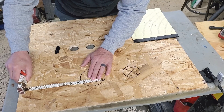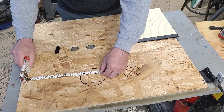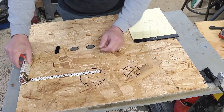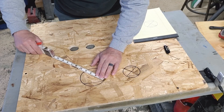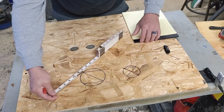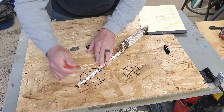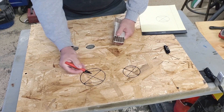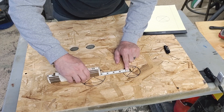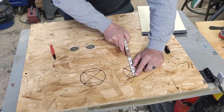We'll do this one here, we're gonna go with three inches. Get our Z and finish it off with our X. And there you have it — there's your center mark. From center to the outside it's an inch and three-eighths, and it's gonna be an inch and three-eighths all the way around.